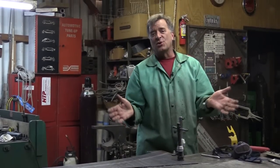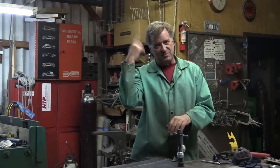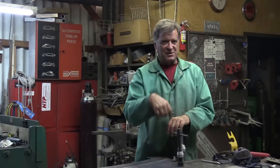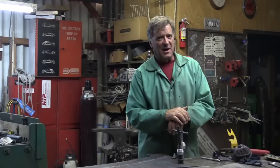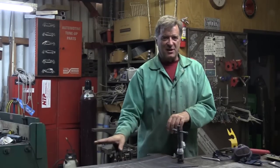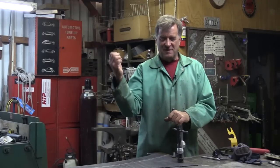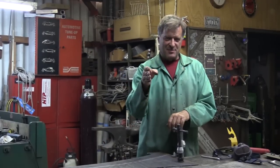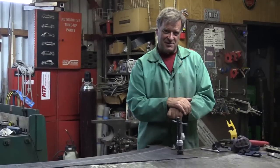So that gives you a few things to watch out for when you're using your plasma cutter — a little mental checklist. Make sure the compressor is on, make sure the water separator is in place, and so on. It'll help in the end: you'll get better cuts, your machine will last longer, less frustration, more work done, and you end up a happier guy at the end of the day.